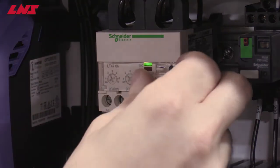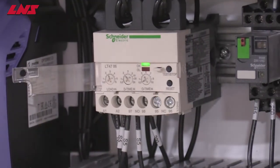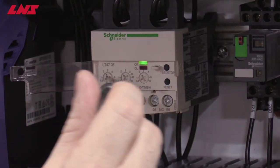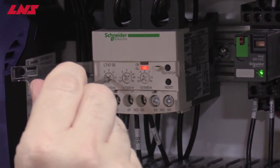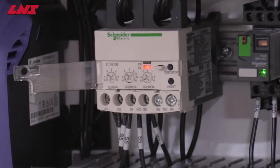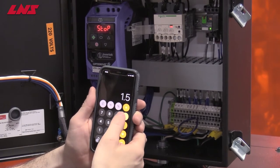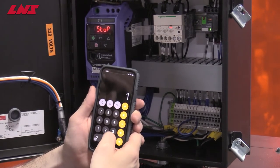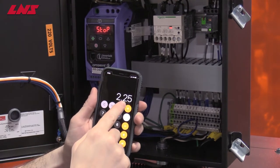To adjust this, open the flap. Using a small screwdriver, reduce slowly the dial until the conveyor trips. Take that value, times it by 1.5, and this is the setting that you need to use.